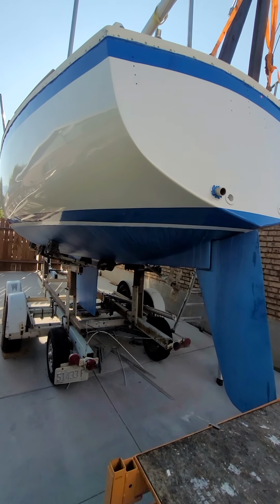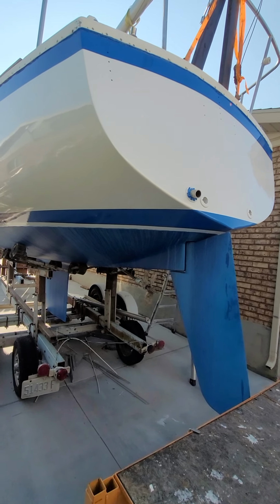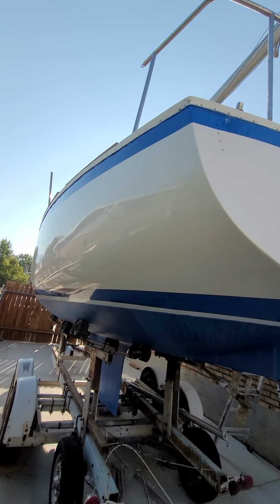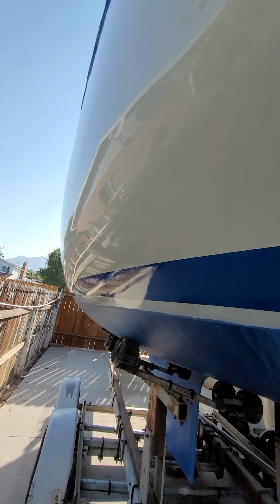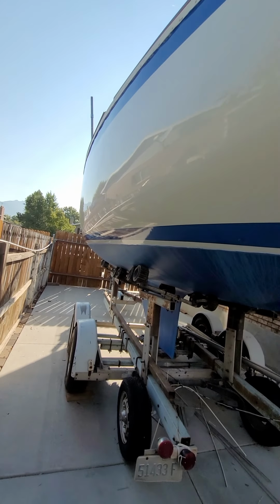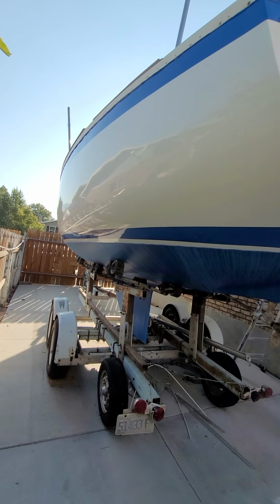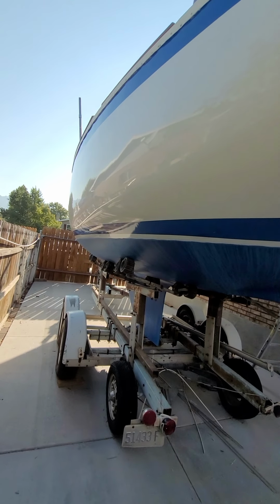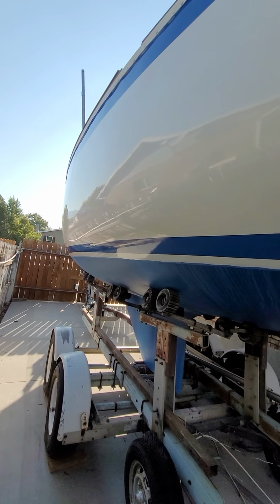I also use the little 4-inch mohair Red Tree 1/8-inch nap rollers if I didn't want to roll and tip. I actually did the stripes with that, and I did still tip it, and you can see it's pretty much the same. I do find that the 4-inch mohair rollers tend to give it a little bit more even coating than the foam. With the foam rollers, you've got to really watch, because like I said, you'll get a run that you just were not expecting even after you work the paint.